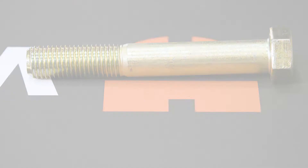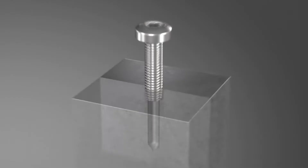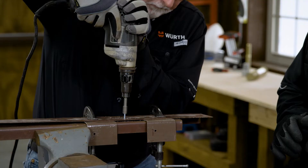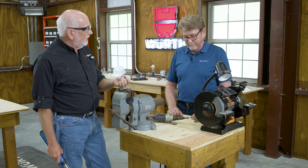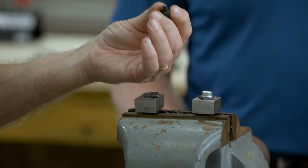Those are some great episodes to film — lots of demos, lots of fun. So we've covered metal and plastic screws for assemblies. We've covered self-drilling screws and we've even covered the new TapTite Pro. Strip out is the normal, everyday mode of failure for thread rolling screws. TapTite Pro achieved full tensile break, equivalent to 10.9 — which is also, for our American friends, equivalent to grade 8. And it broke.